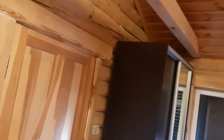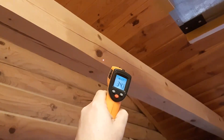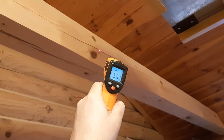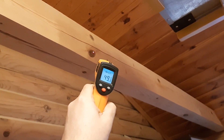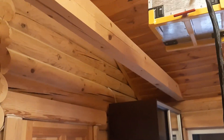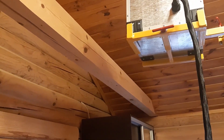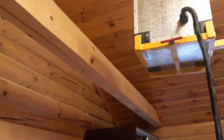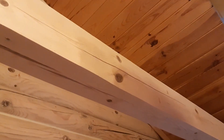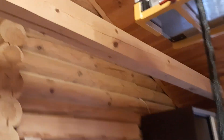Let's pull it back and measure the temperature with the pyrometer: 56 degrees, 47, now 50. That's enough to kill the woodworm — it took us just a few minutes. Thicker beams will require more time, and the temperature should then be a little higher, about 60 to 70 degrees, just to be safe. Boiling resin will then pour out of the holes — the worms will get it hot.